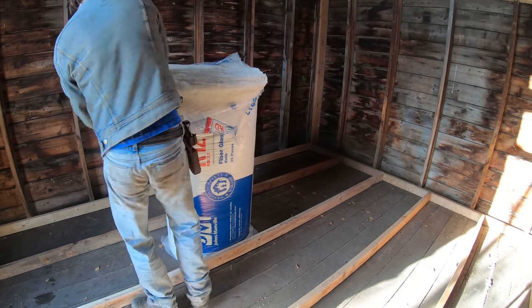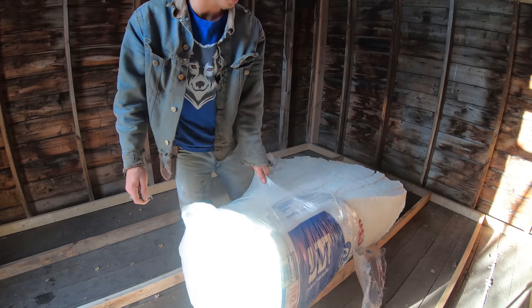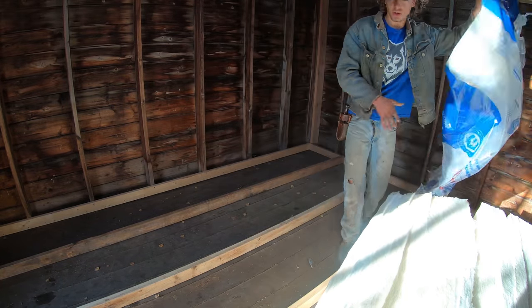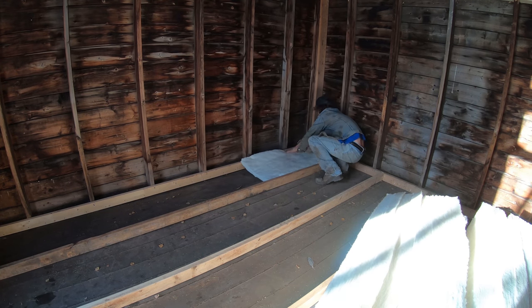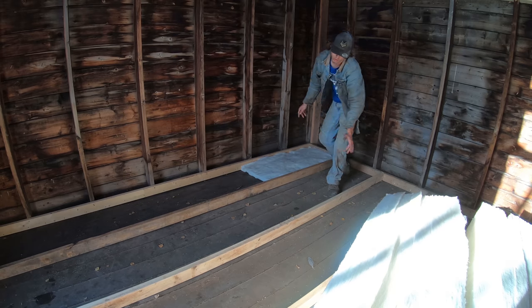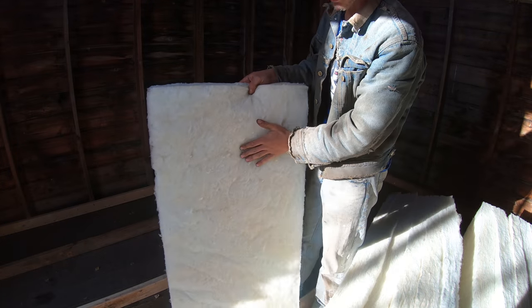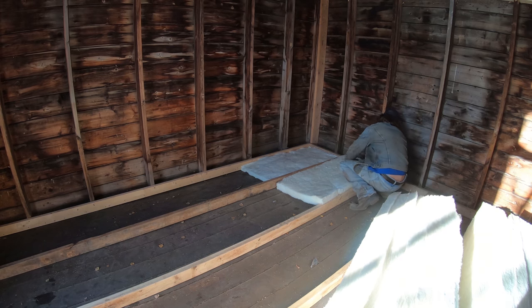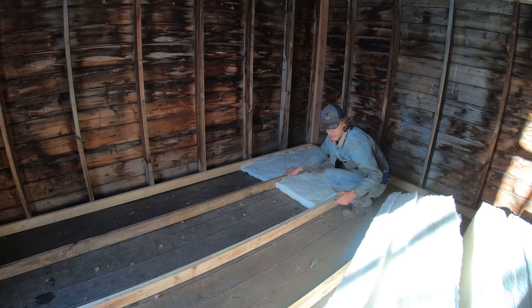We'll get right at her. I think this cover is 150 square feet. Now, we're 12x14 here — 168 square feet, so we'll probably make her out here all right. Do all my big pieces first. We want her nice and fluffy in there, and tucked up good to her corners. Now, this fiberglass insulation is at its best when it's good and puffy like this — if you scrunch it up, it loses its value. I'm kind of risking it here putting all this in here before we got the roof on her, but I'm just going to give her. I'm going to get all this stuff done.